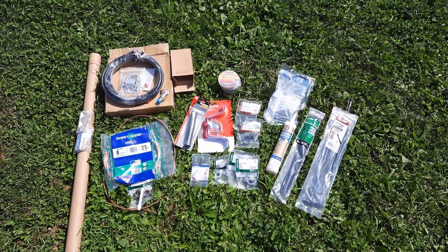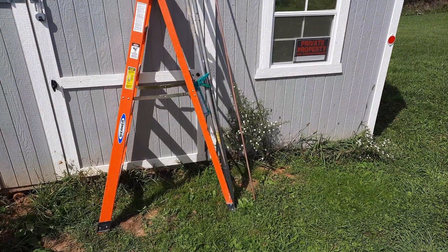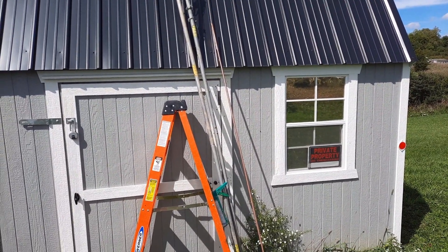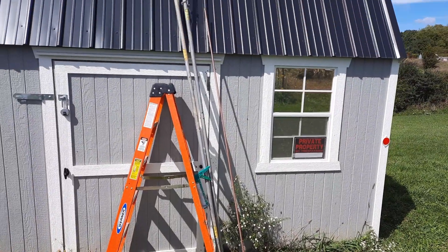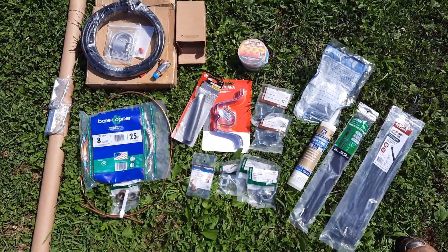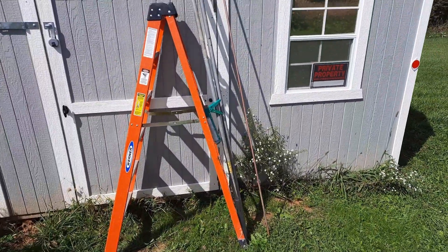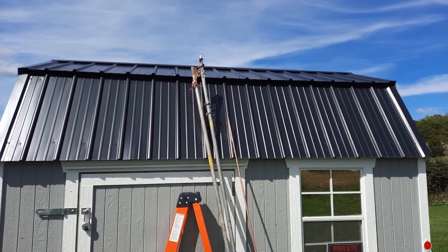That gives you an idea of the basic supplies needed. We've got a copper ground rod and an antenna mounting pole that comes in 5-foot sections — totaling 20 feet when assembled. If you can't find an antenna mounting pole, use 1.5-inch EMT pipe, which is electrical conduit that comes in 10-foot sections. We'll attach the antenna mounting bracket to the side of the building first, bolt it in place, then stand up the 20-foot pole, assemble it fully, attach the antenna and all hardware, then stand it up and hook everything up for the Bobcat miner.